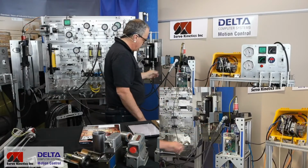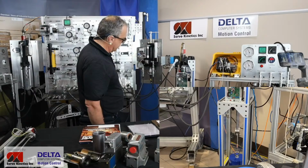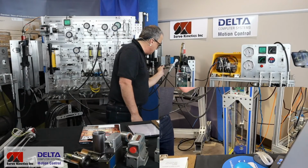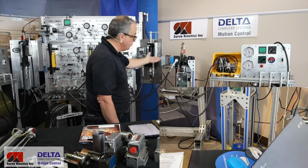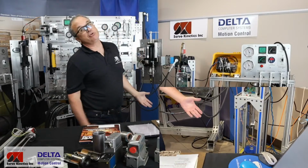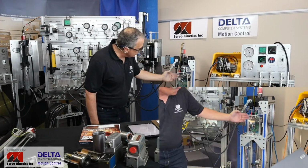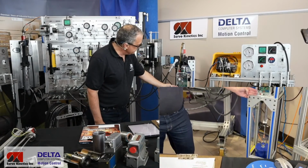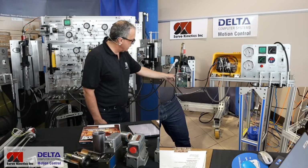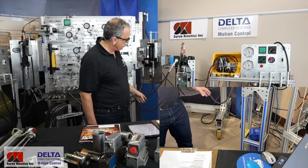So that's the nulling of a valve that allows for mechanical nulling from the outside, because now once you're cabled back up, if you've mechanically nulled and it's still drifting, well, now that's a drive signal issue. You've got to look at what your drive electronics are. We've got a manual analog driving amplifier for the valve on this side. We can flip a switch and change over to a Delta RMC 75 and control it that way instead.